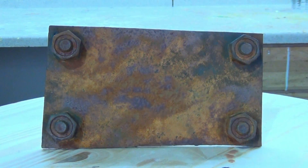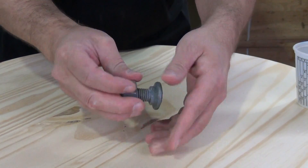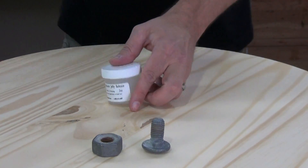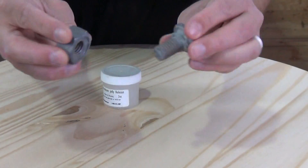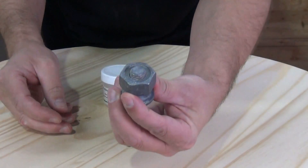As an added little bonus we're also going to show how little parts like this can pair nicely with our Iron B metal coating. So more about that later, but for now let's get started with the bolt we're going to mold. This is a little nut and bolt that I had sitting around the shop and we're going to mold it coming through a piece of foam core board so the end result will look like a bolt that's holding a metal plate onto a surface. Parts like this are really popular for haunt interiors and themed environments and again really go well with the rust look.